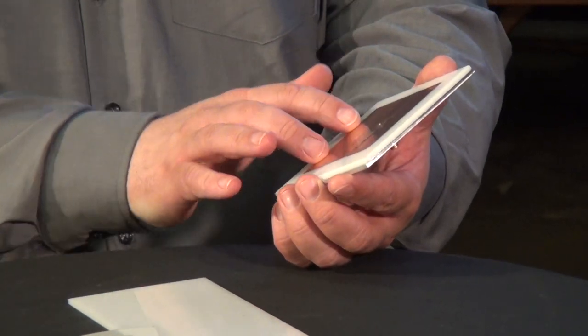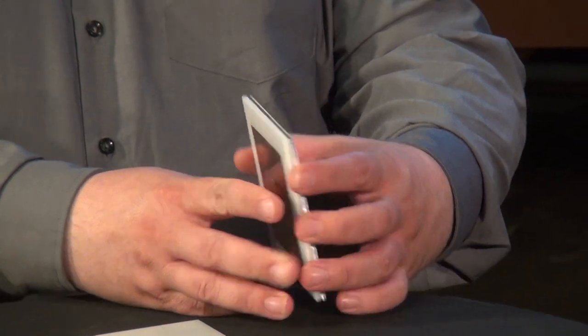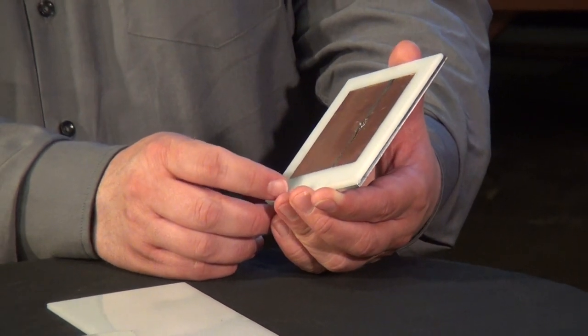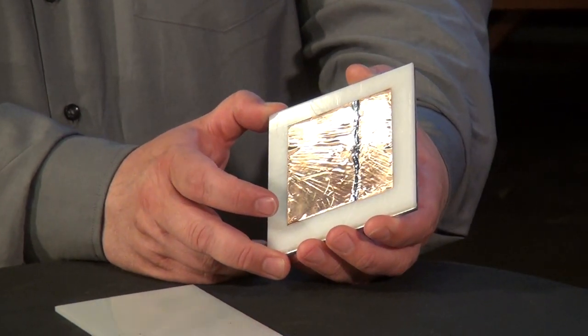We have this thin part which is the antenna element on the front, and then just the back plane that guides it, and then this sandwich structure in between. In this case we used polyethylene, but air would be more optimal if you wanted a narrow beam. If we want it to transmit in exactly that direction, then air would be a better material, but it would be a little bit bigger. These patch antennas have the obvious advantage that they are flat — that's nice because we don't have things sticking out of the rocket.